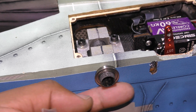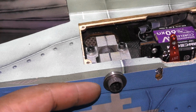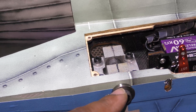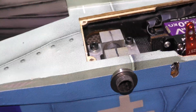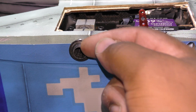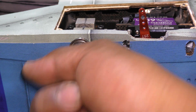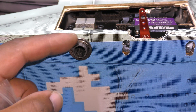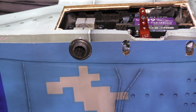So what I'm going to do is add a ball bearing, and I think I've figured out how I'd like to do it. One on the outer surface as you're seeing here, and this one's going to be a flanged bearing — you can see there's a little bit of a lip there. I got a 12mm carbon rod and just sanded it down so I can fit the bearing that I want. This bearing should fit exactly the aluminum rod that goes in here. I'm going to mark around with a sharpie because this has to be very precisely mounted in the spot.